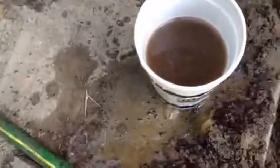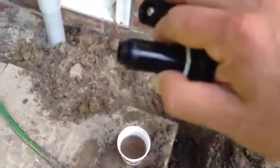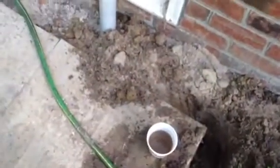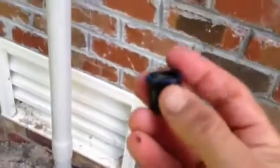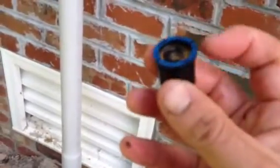Once you've got it nice and clean, lift it up — all you do is literally pull it up with your finger — and unscrew it, then wash it off and see if that helps. We're holding the actual shaft of the irrigation head between thumb and forefinger. This is the actual nozzle. What you want to look at first is whether there's anything clogged underneath it. Then look at where the water actually comes out — see all those dash marks? That's your spray pattern.